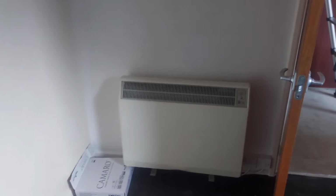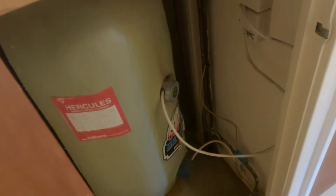And the kitchen has a Dimplex CXL storage heater. It's classed as an integrated storage heater, with a peak heater strapped to the front of it and a storage heater in the back. Dual immersion, spray foam, medium sized tank. I think that insulation is going to be 38mm.